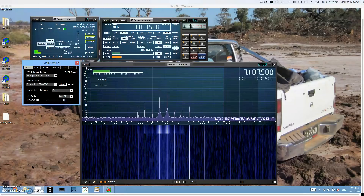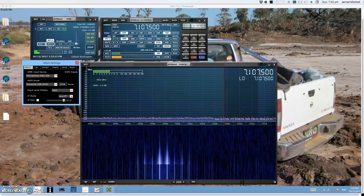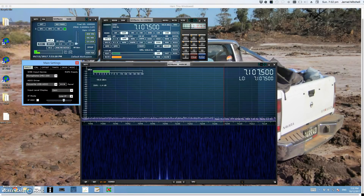Okay, that was about 30 dB down on a single tone, so that's negative 36 dB in the ARRL methodology, which is PEP. So let's go down to 75 watts now, and we'll do it again.